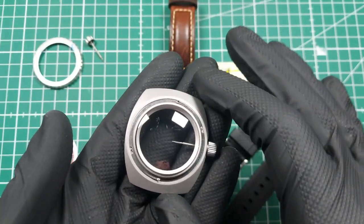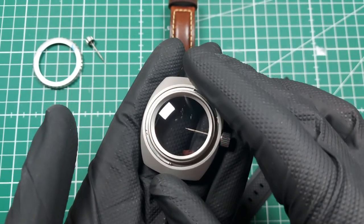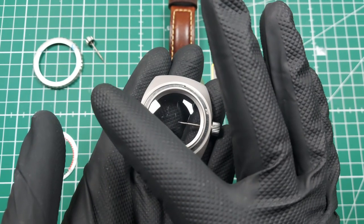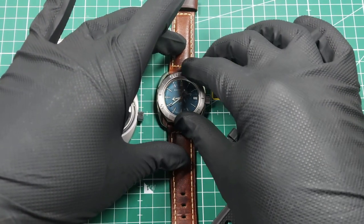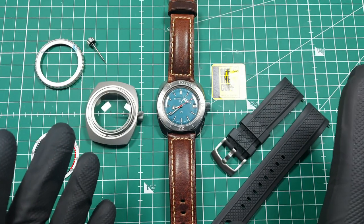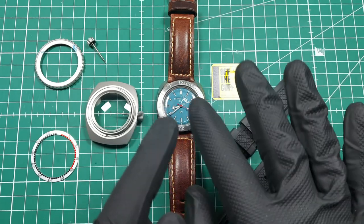The main piece is the custom case. The upgrades you get with this kit include a longer stem, crown, and two key benefits. First, it's a bead blasted finish, beautifully machined. It comes with a click bezel spring identical to what you get in the Seiko SKX — a unique feature you don't normally get on a Vostok. The stock friction bezel is sloppy and gritty. Also, this case has sapphire crystal — the original acrylic scratches so easily and makes the watch look scruffy.